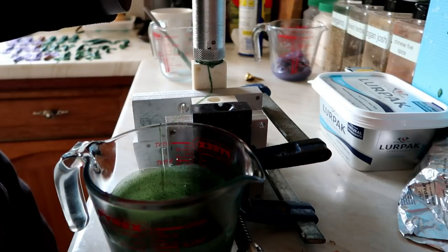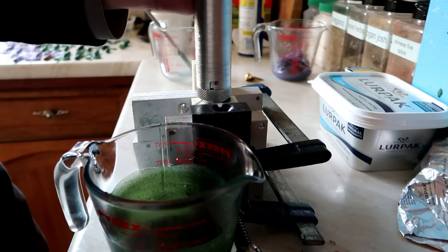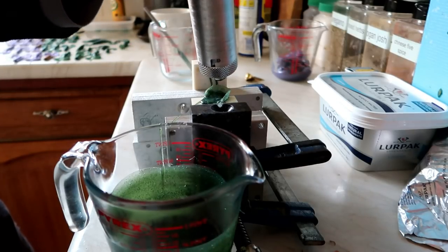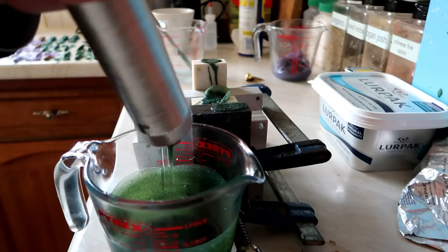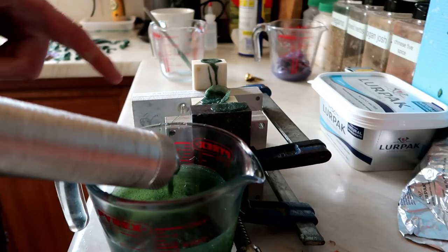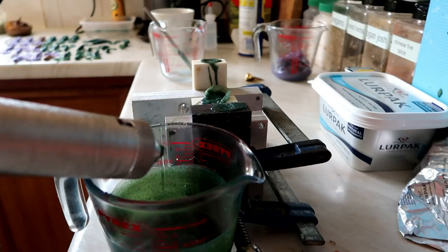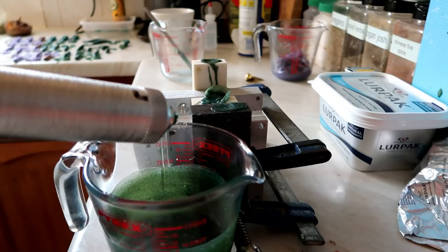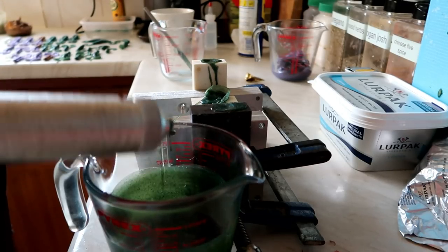Plug it at the mold, push firmly, wait literally a second so I know that's full pressure, and that's going to fill all the cavities of the mold. Just work my way along the molds I've got here — I've got some aluminium molds and some porcelain-kind molds. Once I've done all my molds, I scrape the spare plastic back into the bowl — it'll stay in liquid form once the hot soft plastic touches it, so I could inject straight into another mold by sucking the plastic back up.